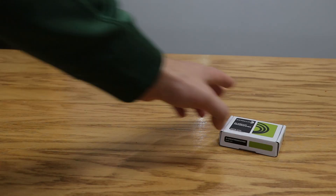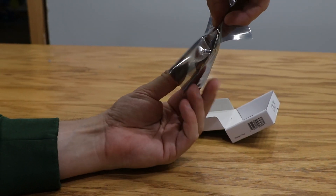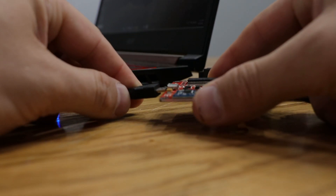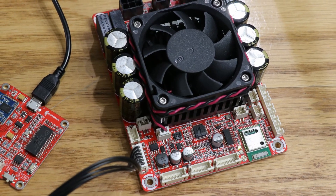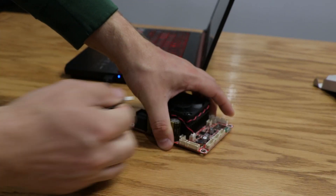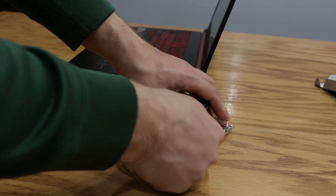That is why I said this could really transform the way that you build and design speakers. The DSP board isn't the only thing you need, though — you need something to communicate between the computer and the DSP board, called an in-circuit programmer. This just plugs via USB to your computer and then plugs directly into the board, communicating and saving the program onto the board. Once you've created a great project and want to start selling, you can buy as many boards as you want, plug each one up to the in-circuit programmer, and save the file directly on there in a matter of seconds.